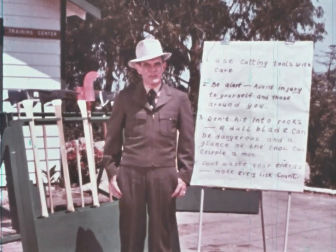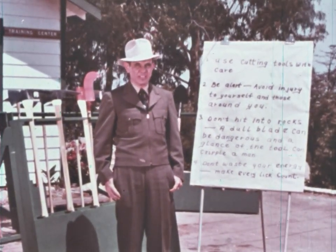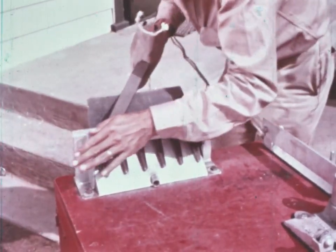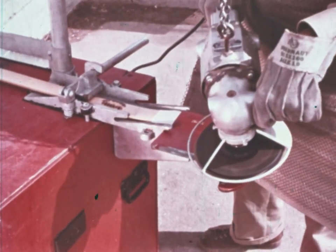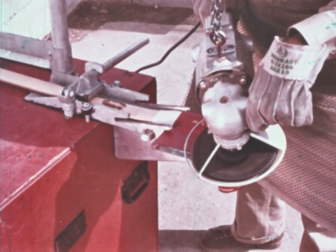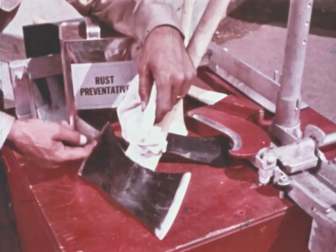There are a few important things about the storage of hand tools. Before any hand tool is stored, it should be given a thorough maintenance check — cleaned up and checked for cracked handles and loose blades. Some sharpening is needed if the tool has been in use. A single-cut mill file or an axe stone will put on a good cutting edge; the file should have a handle to avoid cutting the hand if a slip is made. Care should be taken with power grinders to avoid getting tools too hot, as this takes the temper out of a cutting blade. Cutting edges should be properly ground and tapered back, avoiding too much arc on the cutting edge. Use a little rust preventative to keep the blade in good condition while stored — a rusty cutting tool can be a dull cutting tool.